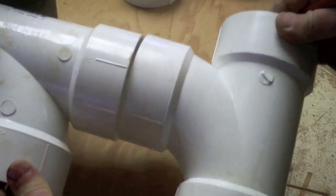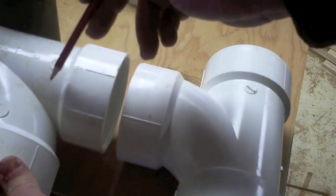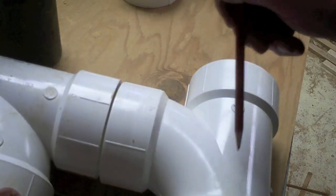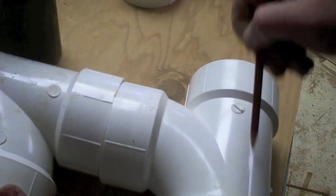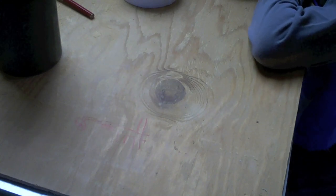I'll follow that up with a second sweeper again, spaced about 10 inches apart, so that any material still carrying can fall down. Once again, the water will be running backwards traditionally, but our grit should not be able to make that corner. At least that's the idea. And I think that using just a handful of plumbing pipe, we can make a very effective passive sand filter that I never have to worry about changing any sort of screens on.